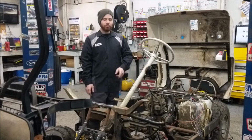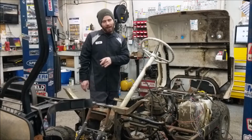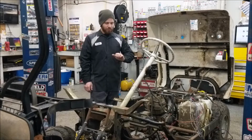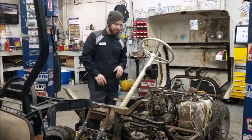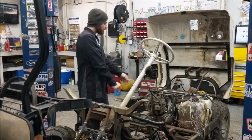We did get a new master cylinder for the front brakes. Got it all bled and everything. I have to take the front calipers apart because the pins are frozen, so it's got a really squishy pedal and doesn't really stop that well. Minor details. We don't need to stop. It's all about going. It's all about the fun.